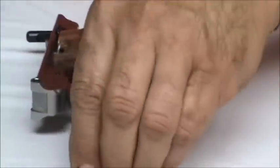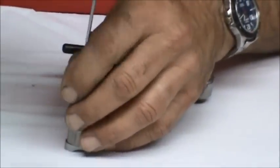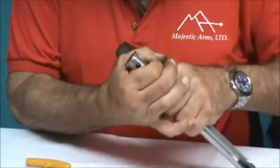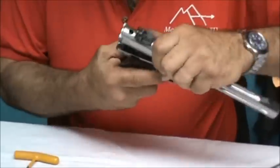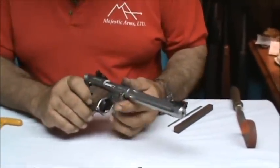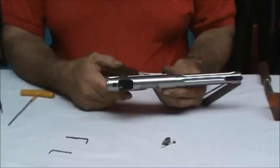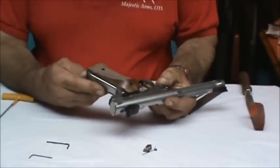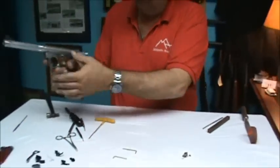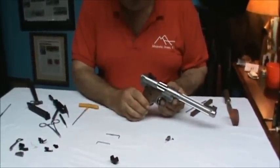Take that and drop it right back into the frame, put the retaining screw back in. Let's check one more time — we should have a perfectly shooting target gun right now. Look at that lockup — perfect lockup. The part comes back out and it's even got a little resistance when I undo it. Make sure she locks tight. No play. Your gun now has a beautiful two pound trigger pull, very short stroke on the trigger — as close to a true single stage as we can get. It'll fire without a magazine, the magazine disconnector is gone, we've got the hard core magazine ejector in place, an extended bolt release, and it throws the magazines far out with a nice clean two to two-and-a-quarter pound trigger pull.